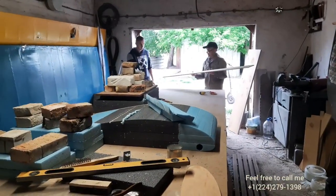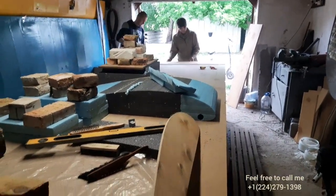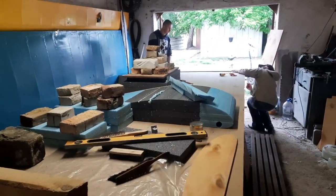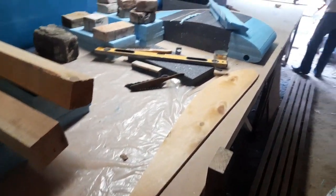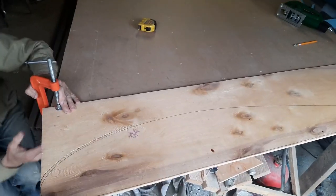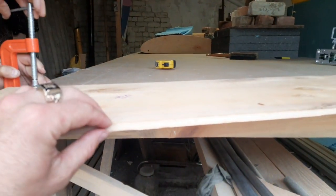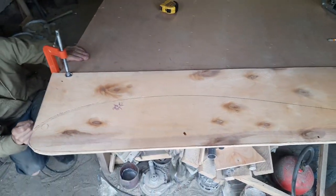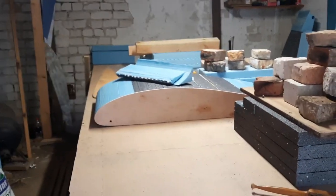We're working on our ribs. This is the rib — it's a process right now. We're creating a wooden rib and that's how it's looking. This is not a solid piece of wood — it's slices of small pieces of wood glued together, which makes it very, very strong. We're gonna glue it to our foam blocks, and that's how it's gonna look inside of the wing.